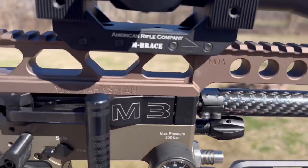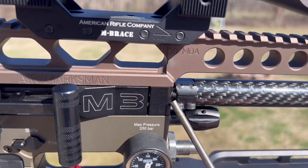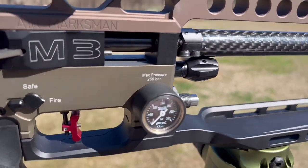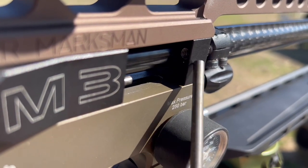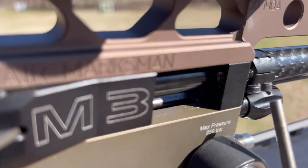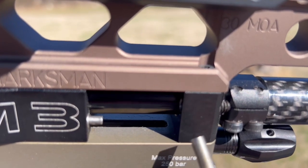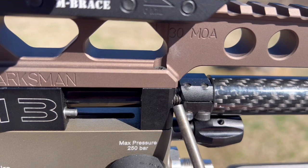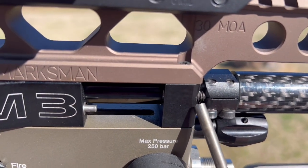As you can see, I've got a set screw right there. This front block my machinist buddy drilled and tapped. The front screw is drilled and tapped behind it — you can't access this set screw with that piece in place, so all of this has got to be set up prior.